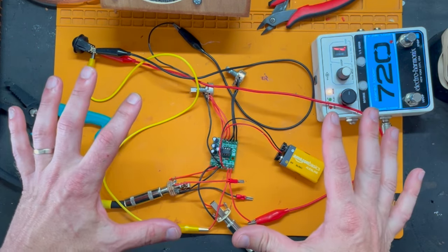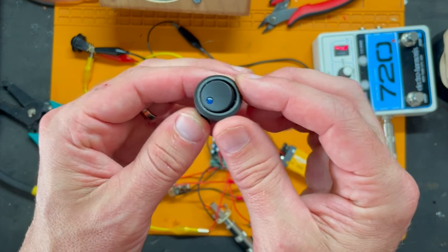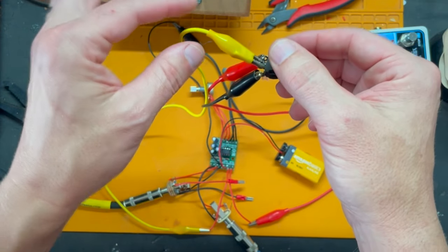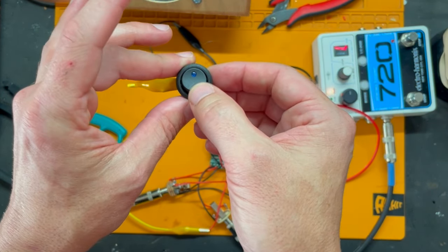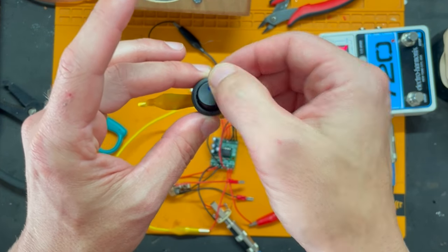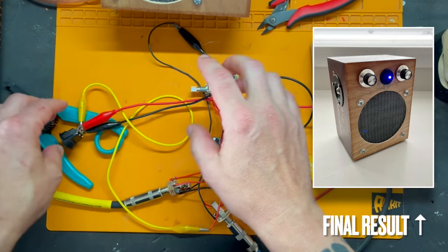Just a quick addendum to this video. When I was doing the final thoughts, I mentioned what if I had a light-up switch — and I could easily add an LED to the circuit. Well, I forgot I have a couple of these. It's what you'd use to add fog lights to your car — just a basic toggle, but there's an LED built into the toggle. So I pulled the circuit out: the yellow wire goes to the battery, the red one goes to the circuit, and the black one goes to ground. If I hook this up correctly, we should get an LED. I've got a loop pedal here to test it — and you can definitely hear that's working. So I just need to drill the hole a little larger for that switch, mount it, and wire it up. If you like what I do on this channel, please hit that subscribe button. If you like this video, give it a thumbs up. I need to go take a shower.